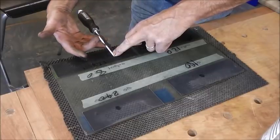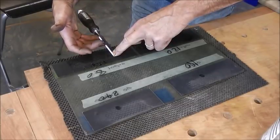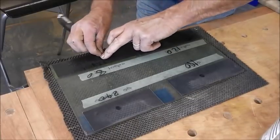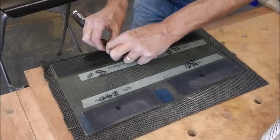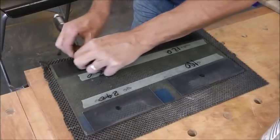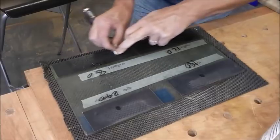I've actually got one or two fingers just hooked around the blade there just to stabilise it. If I don't have them there, it sort of rocks around and wobbles around. All the intention is on keeping this really flat on the abrasive. That's vitally important.